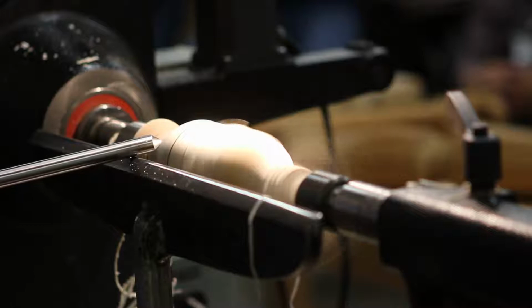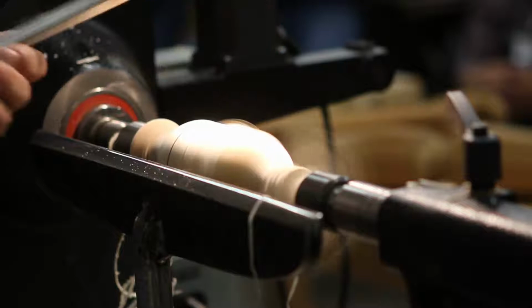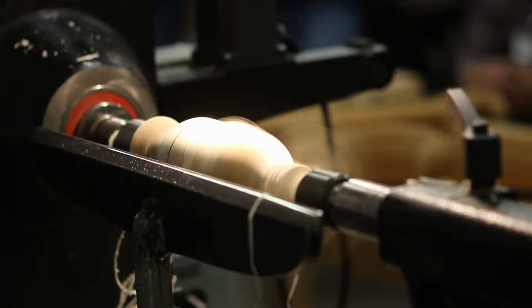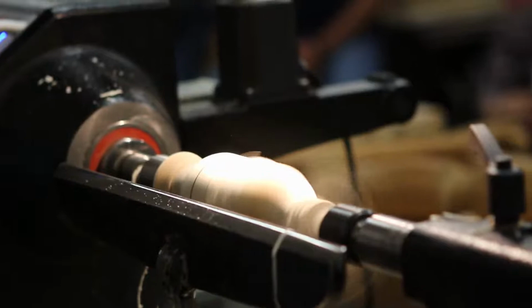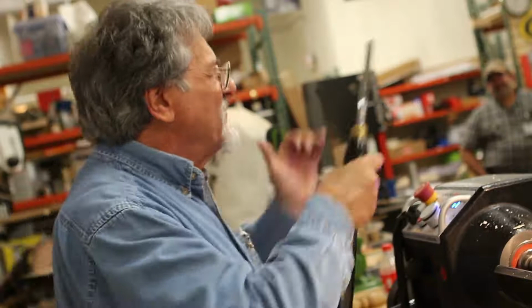Now, with a very complex shape like this, which is curved this way and this way, getting that part of the edge to touch that circle exactly vertical can be tricky. This is exactly the problem that you face when you're starting in at the rim of a bowl to go down. You're trying to get that chisel to be stable as it first enters, and then zing! But once you get in about an eighth of an inch, then you've got the bevel rubbing and everything's fine. This is really the same thing.